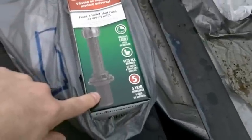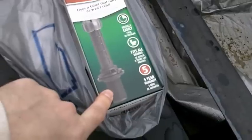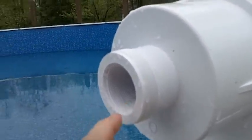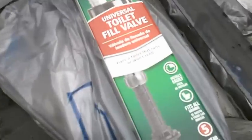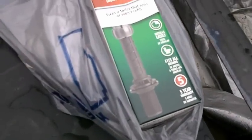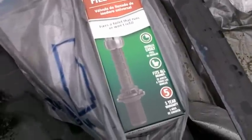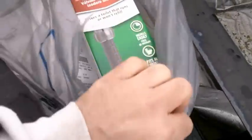The problem in adapting this thing is, first, I couldn't find any type of adapter which would screw into the skimmer itself. This is an inch and a half fitting. Unfortunately, this — which is a toilet fill valve — is not inch and a half, not inch, not three-quarter inch, not half inch. It's seven-eighths inch, which is a very oddball fitting.